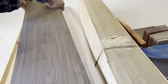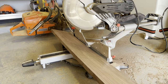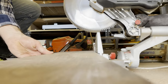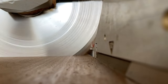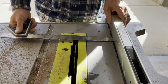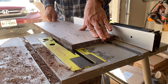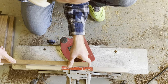Typically with office chairs, the backrest tends to be a bit longer, which is exactly what we are working towards here. The debate in my head was what exact dimensions we wanted to make this to fit a child through adolescence. I needed a headrest incorporated into the final product, and in order to do so, we would have to dimension it as an adolescent since he would obviously outgrow it quickly otherwise. So after some careful measurements based on ratio, we execute — freeing up some clamps from the seat assembly and clamping the boards to complete part one of the backrest assembly.